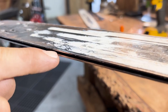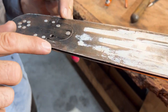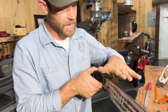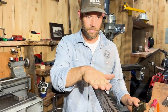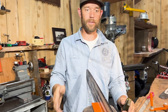On this particular bar there's some chipping out of the rails — it's definitely something you'll get at the end of the bar's life. Also, this portion of the bar will start getting skinnier and skinnier as edges get rolled over and you tune them down. You can see here the bar is skinnier than the factory tip. Using this little jig I'm going to try to flatten both rails to the same plane — if one rail is lower from wear and tear, we want an even plane so the chain isn't favoring one side, which can cause it to pull one direction.